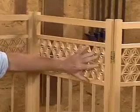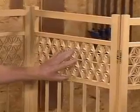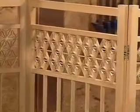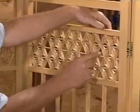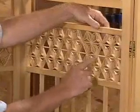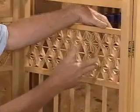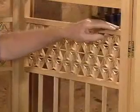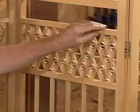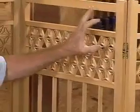It's wonderful. This grill work, and this is called... All of the grills are kumiko, and this is just a special type of kumiko grill work. It's constructed. Kumiko, okay. But you mean by constructed, this is built up of long sticks. Right. Long pieces of wood that are joined together with joints at each of these intersections. That's correct, a lot of joinery. So it's not sawed out. And what kind of wood is this? It's Alaskan yellow cedar. It's old growth Alaskan yellow cedar, picked for a very, very tight, straight grain. Well, this is a splendid use of a very rare wood.